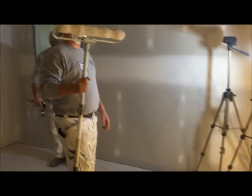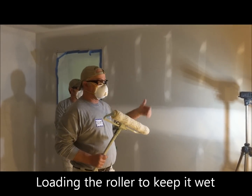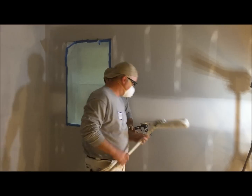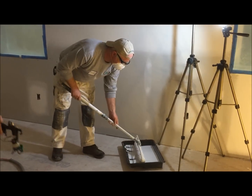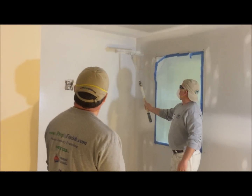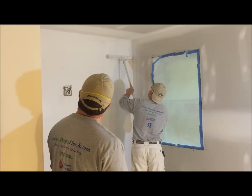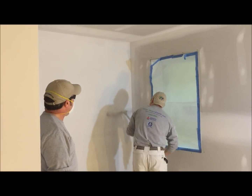We're going to keep a roller tray with us for this roller. I'm not really interested in taking paint out of the tray to put on the wall — all the paint that I want to work with is on the wall. The purpose of this is just to keep the roller wet. If it starts to dry out, it gets a little weird. To load the roller just to keep it wet, you use this little grid right here. You want to start in a corner working from the top down, and it's really key to get within about an inch of that corner, but not dragging to the opposite side.